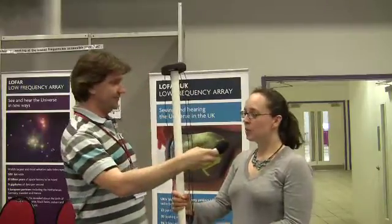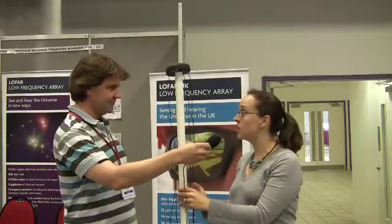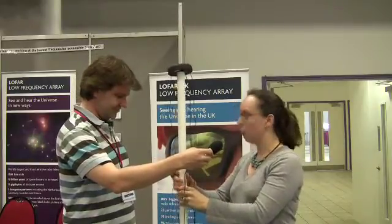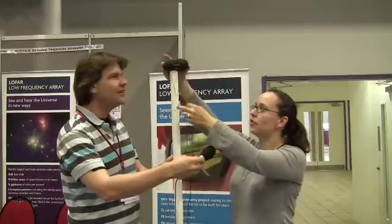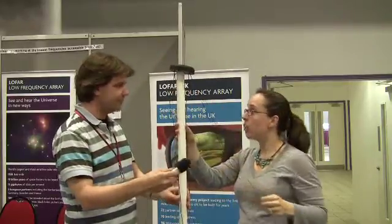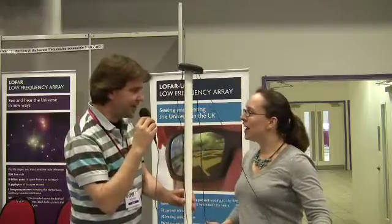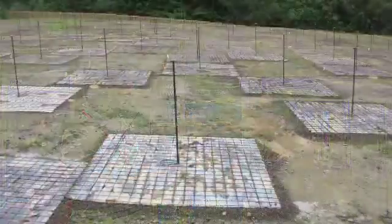Karen is now showing an example of one of the LOFAR radio antennas. What we've got here is the business part of one antenna — missing is the ground plane, a metal mesh put on the ground, which is actually standard building material from the Netherlands used to reinforce concrete. You lay that on the ground, get your pole, feed the cables at the top — this is the low noise amplifier. The antenna wires attach here, and you need four people to do this, almost like pegging up a tent.